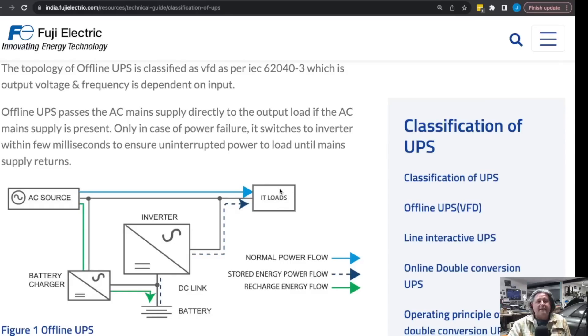This is a reliable way to build a UPS, but it has one downside: in this design you're not using the inverter at all during normal operation. So you might turn the UPS on, your power works great for two years, and little did you know the inverter has a problem. You won't know it until the AC power cuts, the inverter kicks on trying to drive the loads, and then the inverter fails — and now everything's down.